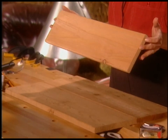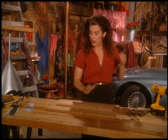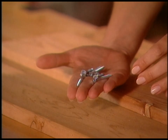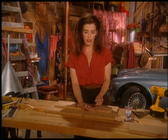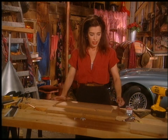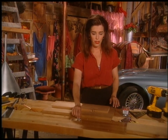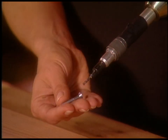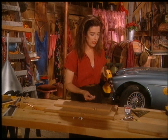This is just cut from a 1x6 that I had lying around, so I'll just more or less center it. I want to show you these zinc screws — these are outdoor screws. Sometimes outdoor screws are coated with a plastic coating that keeps them from rusting, but the zinc ones are great because they're kind of fast going in. Cedar splits really easily, so you want to countersink the screws. You use a countersink bit, which carves out a little depression for the head of the screw so it doesn't sink into the wood and split it.